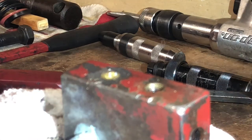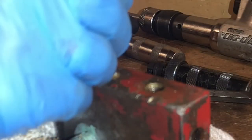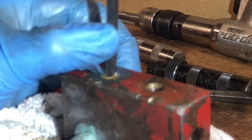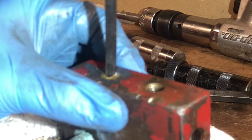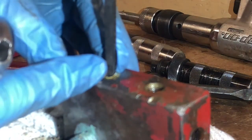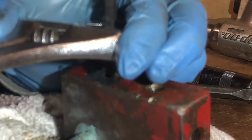Here we are - we've successfully drilled all the way through, though my drill wasn't very straight. What we're going to do is tap this in - tap the easy out as far as it wants to go. I can probably tap it all the way through because it's brass. You want to be extremely careful with this - in a previous video this tip broke off in something. So go as deep as you can - there's definitely a breaking point to these things. Let's see if this old easy out can spin it out for us.